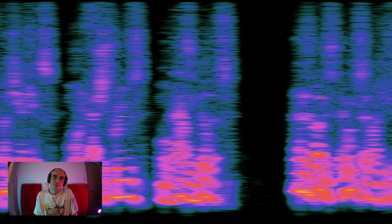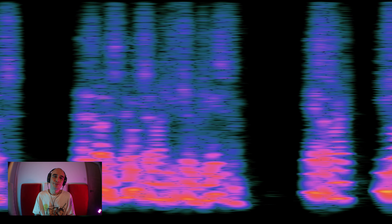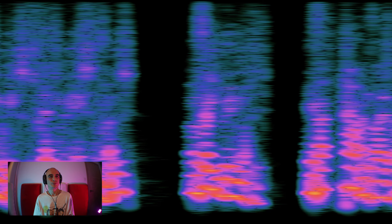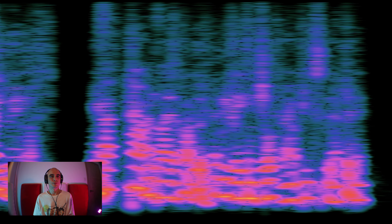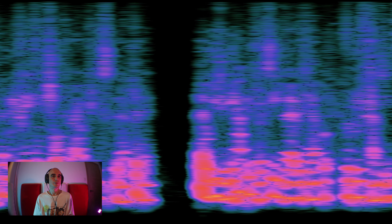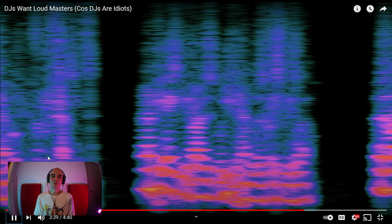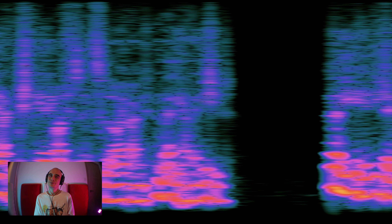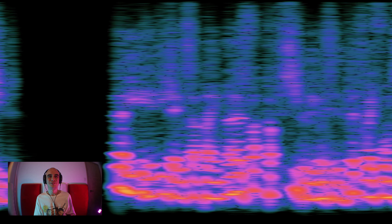Dan adds: as a bonus, less-limited tracks won't kill the PA system. You thought limiting your peaks was protecting the PA from overs? Actually you were doing the opposite. Power amplifiers are quite good at recreating short loud peaks without clipping — they'll usually happily exceed their rated output for brief transients, and PA speaker drivers handle those gracefully. But Dan also says flat-topped, stupidly limited and clipped waveforms rip through speaker drivers like butter. Everything he says is technically correct.